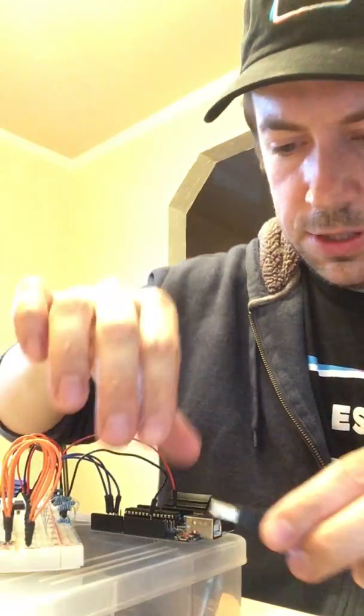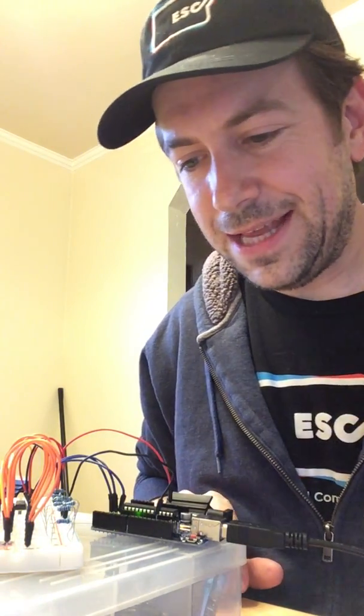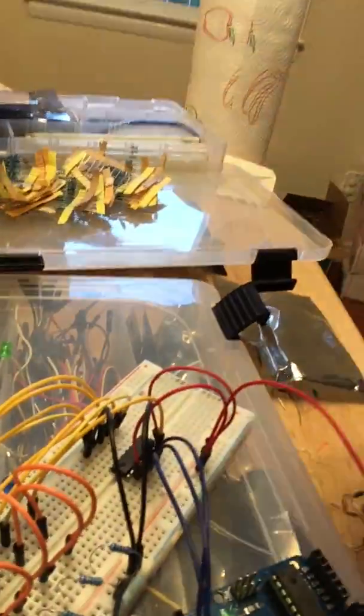There we go. Okay, they're still super weak. All right, that's good to know. And so now here I can actually show you why those guys are super weak. Remember when I was looking at my resistors, it looks like I slipped in some more powerful resistors to those 2 locations. So 2 of these resistors don't match the others, and sure enough, that's what's causing some super weak LED action there. But still, everything works. Just have to remember to take more care with our resistors, and thank you.